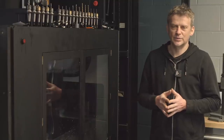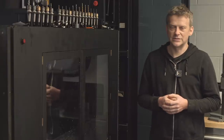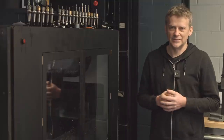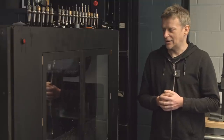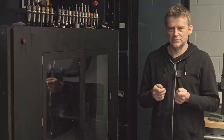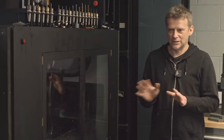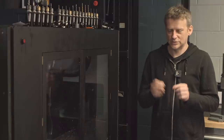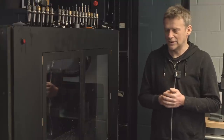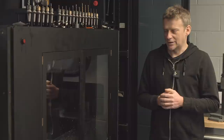In this build, I spend maybe 5% of time on making parts for the CNC, and then I spend 95% of time adjusting it. So it's kind of easy to make the machine between like 10 and 20 microns. So yeah, that's really easy. When you try to go under 10 microns, holy Jesus, that's where the 95% of time comes.